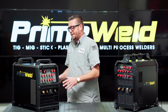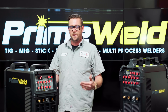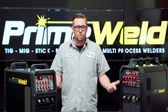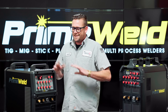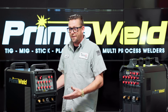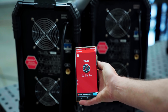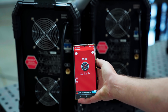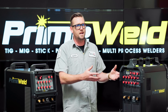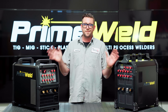The second thing is the fan. This is an on-demand fan, but in all honesty it doesn't take much to turn it on — when you start welding it happens almost instantaneously. And even after very short runs, it takes a long time to turn off. But the biggest issue is the loudness. This thing is super loud — it's so loud that if you put a pair of 225x's running constantly, they are both quieter combined than the 325 when it's on. Personally I'd rather have something like the 225's always-on fan — quieter and you know it's always working.